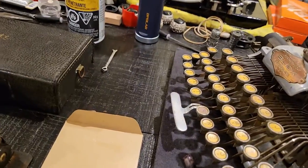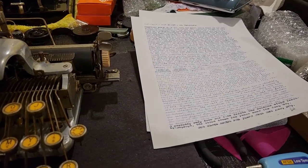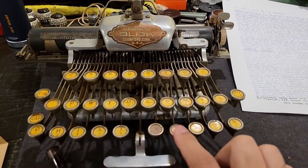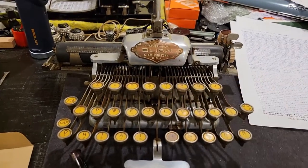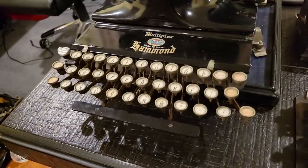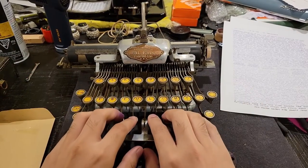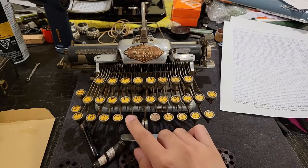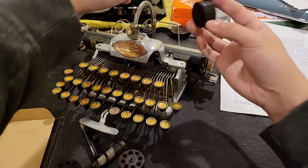So that all works. Now, another thing is, I was originally able to at least read from the type samples on the eBay lots that these were indeed of the DHIATENSOR layout. This layout is what the inventor of this typewriter called the scientific layout, insofar as it was scientifically or empirically designed to be more efficient than the QWERTY layout of the original typewriters, or basically what we still use today. In this case, you would have your home row on the bottom instead of in the middle. And the ordering of these letters, I believe, is with respect to their frequency in the English corpus or language of text.